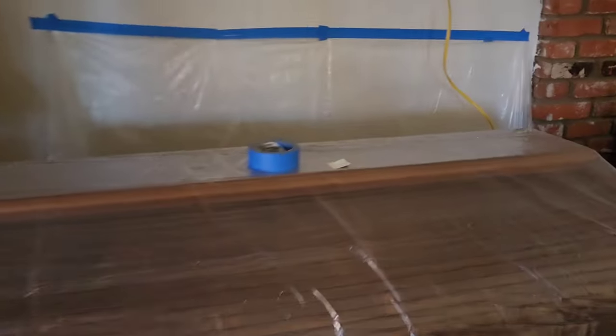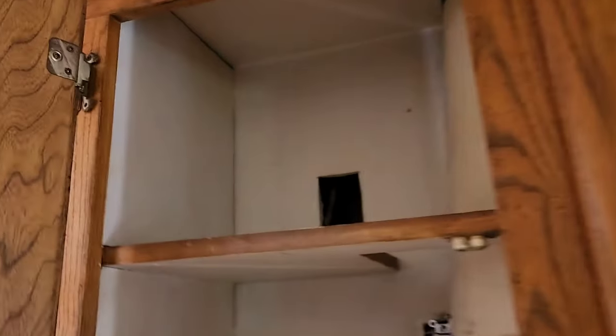All right, guys. Vinny's pulling the cable. He's all the way across over here. He put his hole, as we saw before, right here. And now he's going to drill a hole in the top plate in the attic and pass the wire down, and then we'll put a box with a heavy-duty 20-amp outlet.